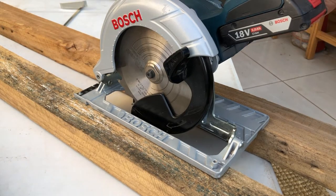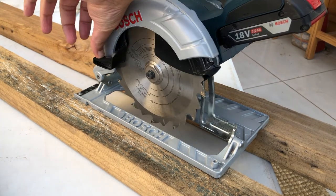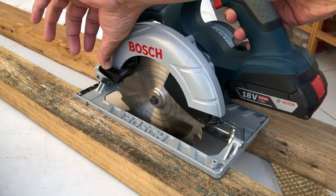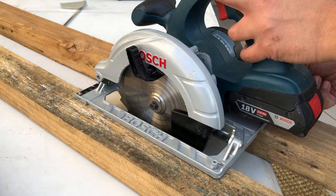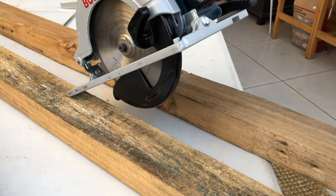From the other side you can see what it means for the retractable safety guard. Once you release the latch, you move the guard out of place and do your plunge cut in order to view where you're actually cutting. Then wherever you need to stop, leave the safety guard and lock it into place — it stays in that same position for your next cut.